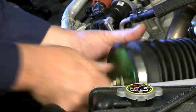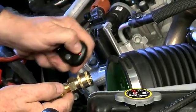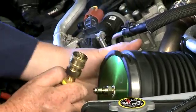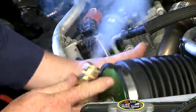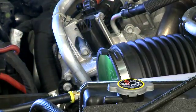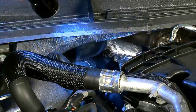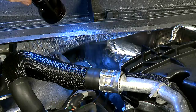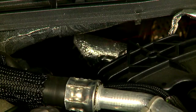Next, let's take a look at smoke testing. Push the on-off button and give it time to start making a lot of smoke from the smoke supply hose. Do not connect it to the system being tested until thick, dense smoke is seen exiting the smoke supply hose. Now that thick smoke is being generated, connect the smoke supply hose to the system being tested. There are three easy steps for finding a leak. The first step is to use a bright light to look for any smoke — this works best when the pressure is low, so start looking as the system is being filled. For the second step, use your laser light and scan areas for smoke that will break the laser light beam, like lasers at a rock concert.